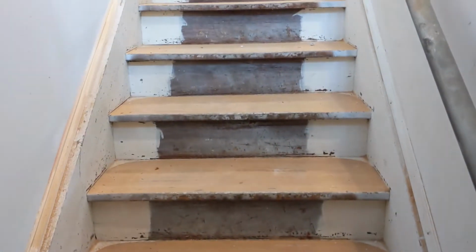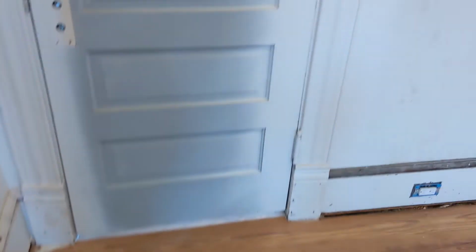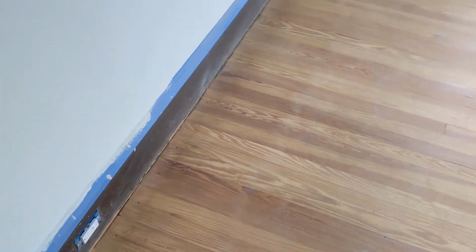And let's just admire the staircase. So again, underneath the riser being painted, tread not being painted. This is their day 2, I believe, that they are working on these stairs. The lights are on upstairs. Look, I got lights. And none of the baseboard or the toe kicks are on, because it's a lot easier to sand the floor, get it all the way into the edge and stain it, as opposed to if you have that toe kick on there. So it looks like they took all the toe kicks off.